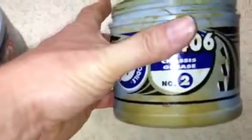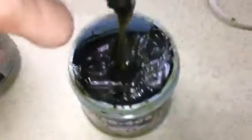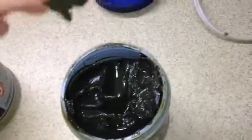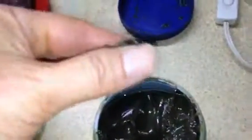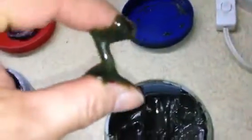And then over here we've got this chassis grease — it's waterproof. This is what I'm changing to if I ever do it again. Look at this stuff — you just can't get it off you. It's on me and it just keeps coming. It's fairly warm in my garage right now, but you'll see it just comes off in strands. It's a medium heat grease, but it's rated as waterproof. It's a chassis grease and it's sticky as heck — it's just all over the place. That's what I'm going to use next time with my pivot bushing: a waterproof grease with excellent sticking abilities.